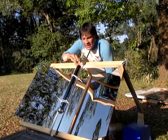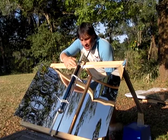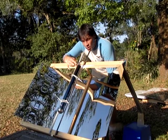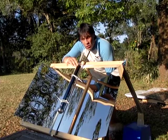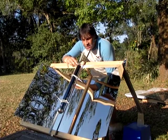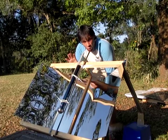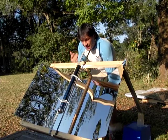I took an evacuated tube and attached it to this. These tubes have a vacuum around the outside with a dark surface on the inside so sunlight is allowed to penetrate. There's water boiling in there right now and I can touch the outside. I did a video on these about a year ago — the link is down below. One thing you never want to do is leave these tubes out in the sun without any water in them because they'll actually get destroyed. These will boil water in about two hours without a trough, just by sitting in the sun. With this trough, there were 30 ounces of water starting at 70 degrees Fahrenheit — it took 14 minutes to boil. This whole setup took me about 20 minutes to build, so this is a really quick way to get a demo unit or if you're just looking to boil water or make a parabolic cooker.